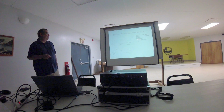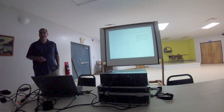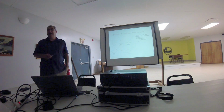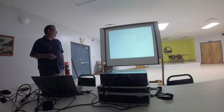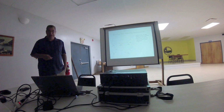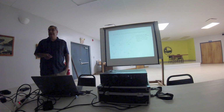I don't go into much about pattern and gain in this presentation because basically the pattern and gain is going to be the same as however you configure this antenna. It'll follow a dipole gain and pattern matching. So the real key here is that you have the feed point down on the ground where it's at a convenient point to work with. You don't have to worry about supporting the feed lines up high in the air.